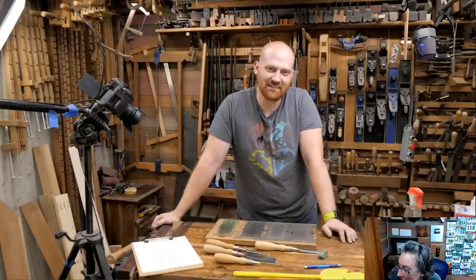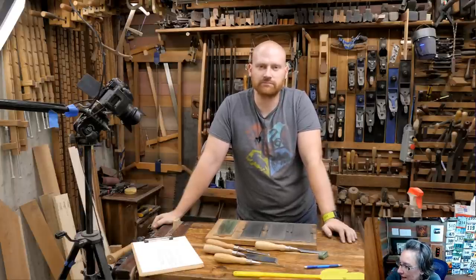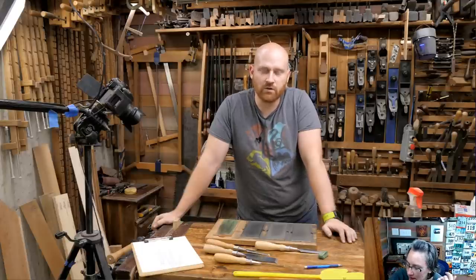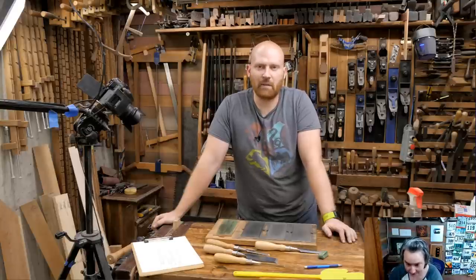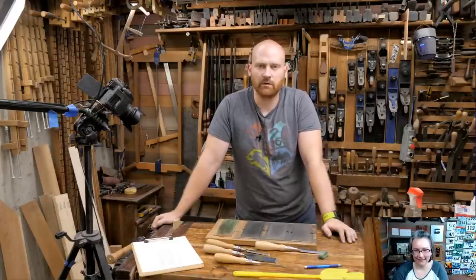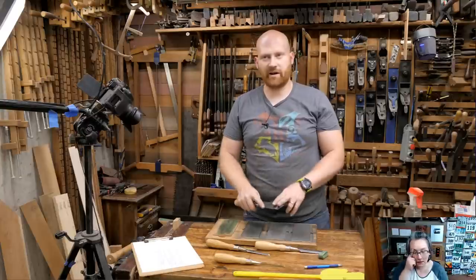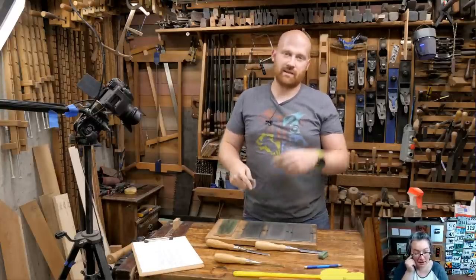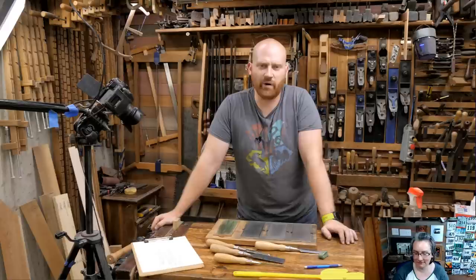Did you answer the question of how often you sharpen already so far tonight? Yeah. I sharpen when I need to sharpen. Caleb Nab asked, do you ever offer the chisel to the grinder or use a jig to reset the angle? No, I don't ever take my chisel back to the grinder. If I find that my bevel is getting too steep or too fine, then I just adjust the angle with my next sharpening. I generally find that over time, my hand starts to drop and I get a finer and finer angle. When I notice that, I just pick it up and hit the tip again, and then I get a secondary bevel for a little while. That fixes it up pretty well. But no, I never take it back to the grinder.